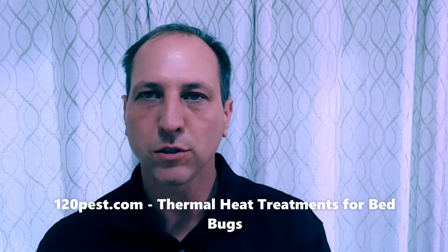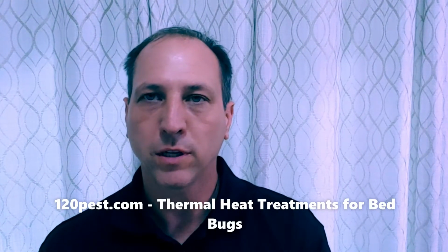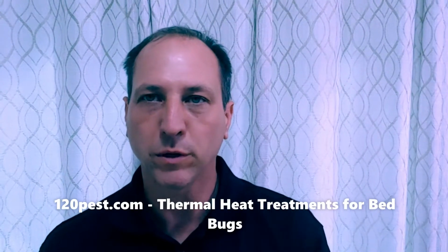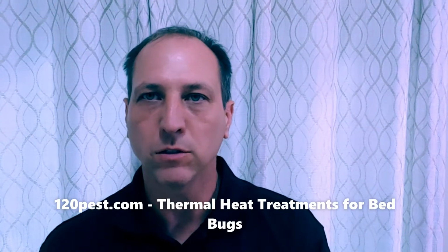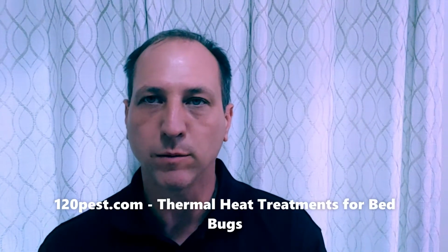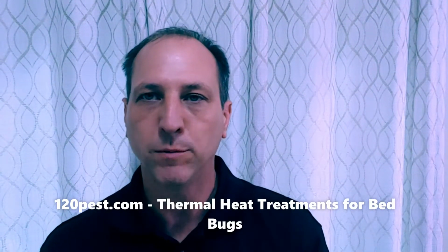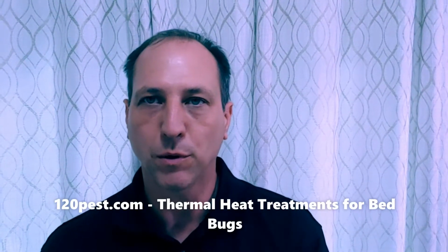During the course of this treatment, we do look for cold spots. We use continuous monitoring temperature sensors that feed us temperatures from outside every 3 minutes, so we can see the heat of every room in real time. We also walk through the house on a regular basis using handheld thermometers to test the temperature of items such as sofas, chairs, and carpet, different things that we feel we might need to test. We also use a thermal imaging camera so we can sweep the room and see the temperature of everything that's in the room.